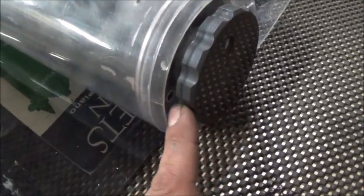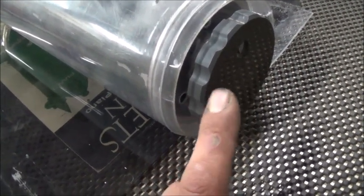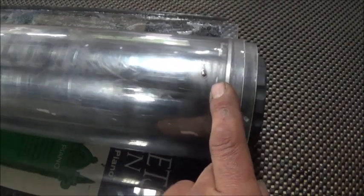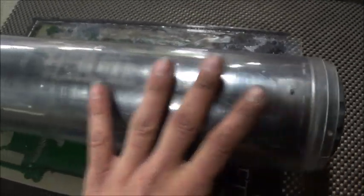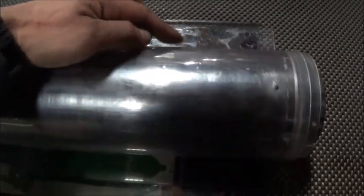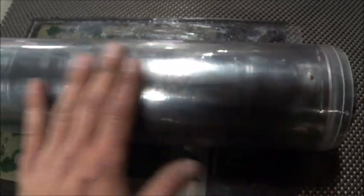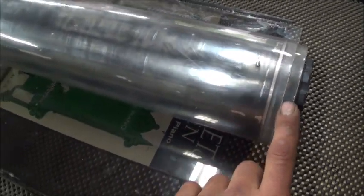That tornadic effect will come back through the cylinder and out our three output holes — you can see them at the tip of my finger back there in the plexiglass case. I may need to make them a little larger, but I figured to start small; we can always take material away. We've got a single air input here; we're going to put four or more on this. We made it clear so we could inject smoke into the Tesla turbine and inject different colors to see where they whirl together and study their patterns. This allows us to do test manufacturing to produce a better product in stainless.